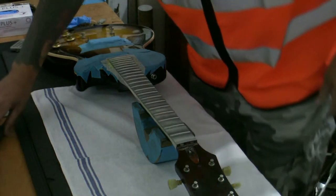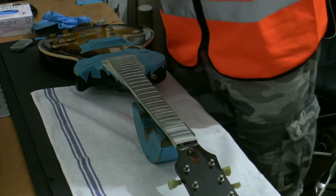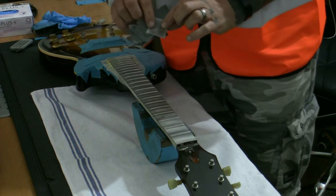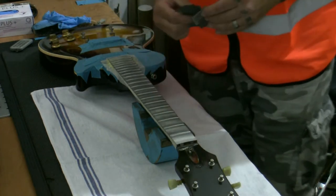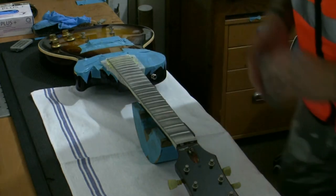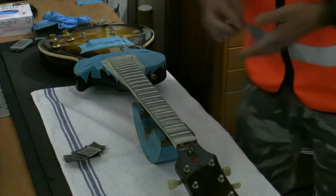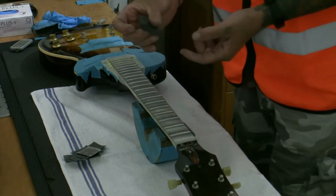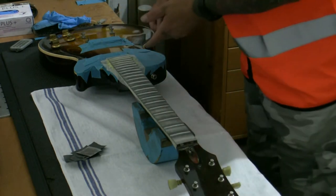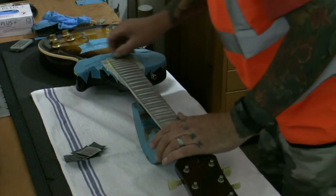So I've been through with the 7 grits of paper, from 400 grit right through to 2000 grit. 400 grit I use to remove the deeper of the scratches. And we're polished just in this direction. They're all polished up bar, I've not finished with the steel wool yet. So we're just going to have super fine steel wool. This is the finest grade you could get. It's super fine, basically, grade 0000.